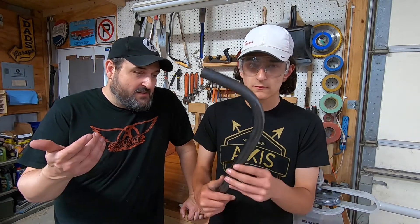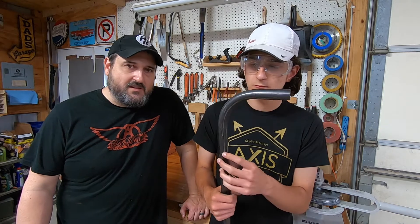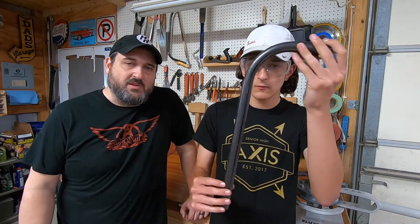So it works. And it'll definitely continue to work for an upcoming project that we'll have in the future — we've got a pretty cool thing on the horizon. Now, this is obviously not probably the proper way to bend tubing. I didn't film a whole lot of making this because, quite frankly, I didn't think it would work. But we used a plasma cutter and a little metal bender and made it into a semi-usable tubing bender. It works — the proof's in the pudding.